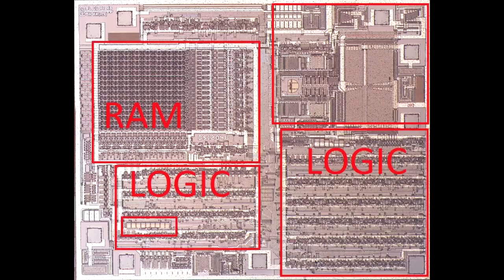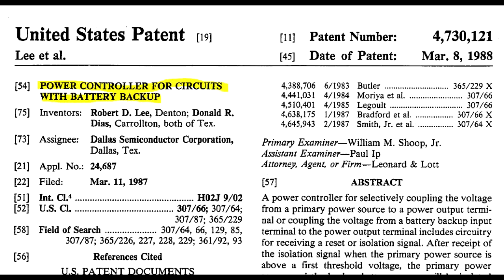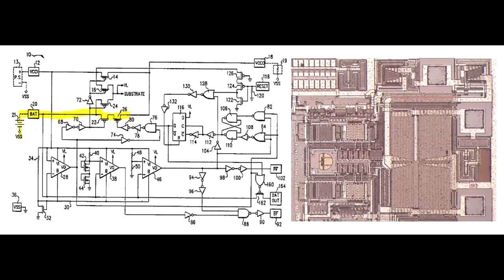Speaking of patents, to sort out the functions in the upper right, the patent system is always very generous and tells us a lot about what's going on. The actual patent for the chip shows the circuit drawing. The more interesting one is called 'Power Controller for Circuits with Battery Backup,' which is contemporaneous with the overall chip patent. That diagram shows two inputs to a RAM for powering: the battery and the external supply. They spent a lot of effort to make sure the contents of the SRAM don't get corrupted. We can see a very large FET structure in the chip drawing that matches the FET shown in the patent, and there's a fairly good correlation between that diagram and the actual analog section of the die.